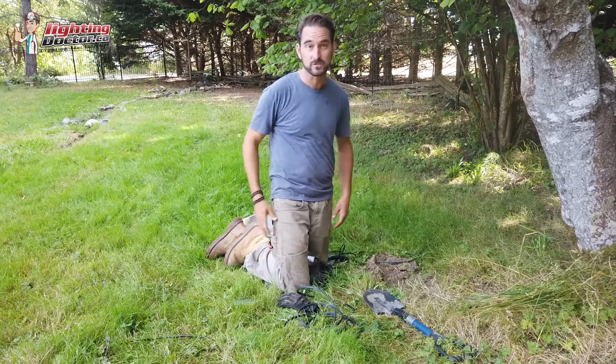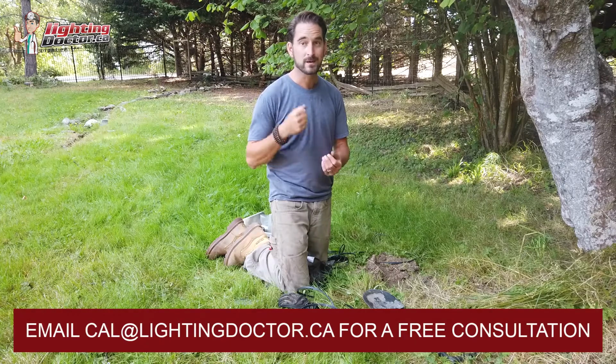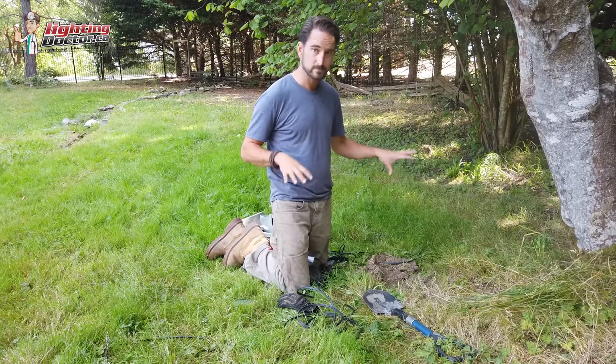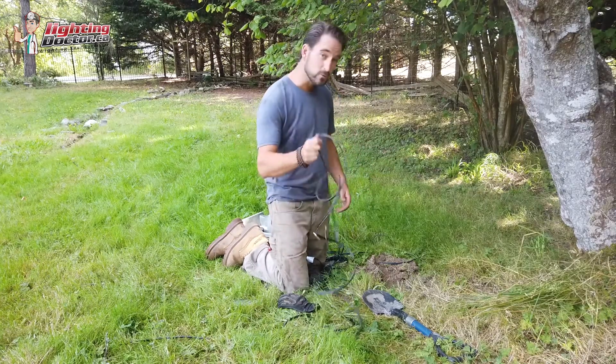This is a huge acreage. It's about 7 acres. I'll give you guys an idea of that later. But even with that and the amount of lights and everything, voltage drop is just not something I'm really concerned about with this one. Again, because we're using a good quality light, we're using large enough wire.